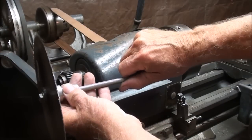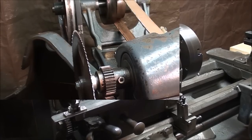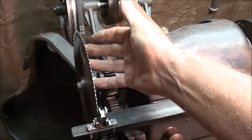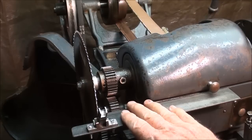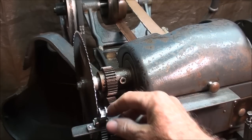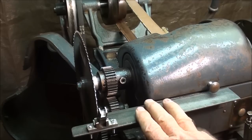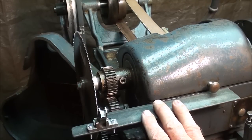I'm going to remount this and get it very tight so there is no possibility of slipping and ruining the piece from the true 100 marks I want. I'll reinstall it off camera. After figuring out how to hold the saw blade in the spindle, I still wasn't done - I had to have some way of indexing it, so I came up with this little device, which is kind of like a pawl but not exactly, though the principle is the same.